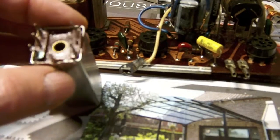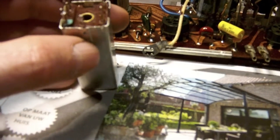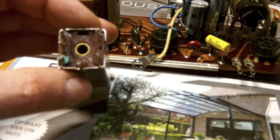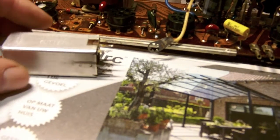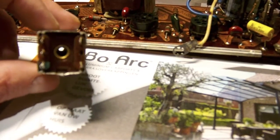Now the problem is, if I leave those capacitors in and mount new capacitors in parallel with the pins, just as those miniature mica capacitors would be mounted, it wouldn't do any good, because they are silver plated mica capacitors, and in my opinion after a while they would start to short out. So whether you like it or not, if you're confronted with IF cans of this type, you will either have to find new old stock or unmount the existing ones and disassemble them to take out those mica capacitors.